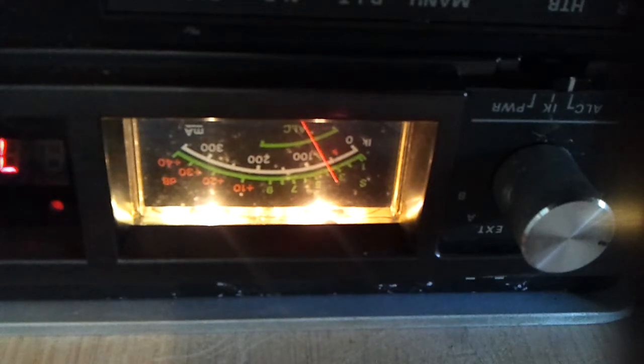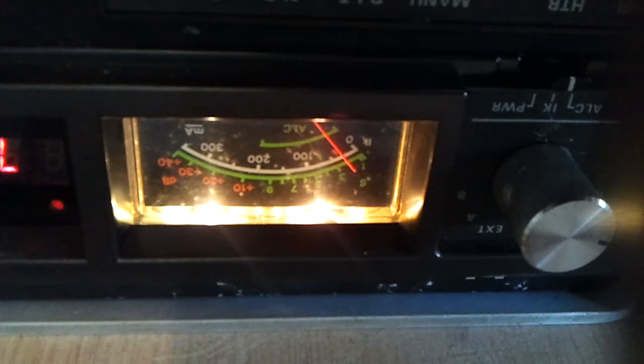I'll show you what happens when the null is misadjusted — keep your eye on the signal strength meter. Because it's the IF frequency, the tuning on the transceiver doesn't affect us at all. That's one side, that's right in, that's through the null, and that's the other side coming back up. I can bring up the signal a little bit to try and make the null more visible. If I were to put in that level of signal on 40 meters now on 7.15 where it's tuned, I'd be pinning the signal strength meter.